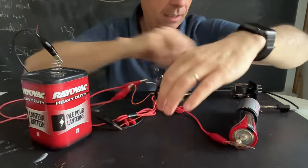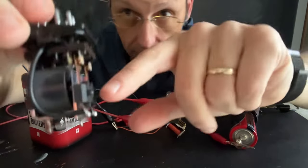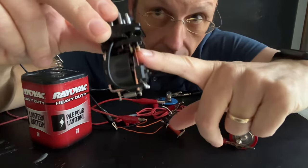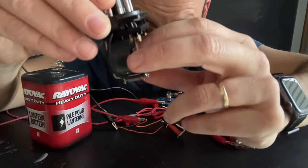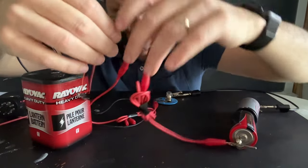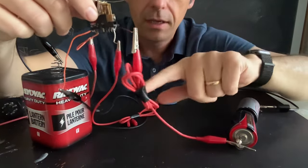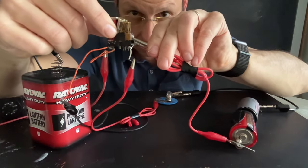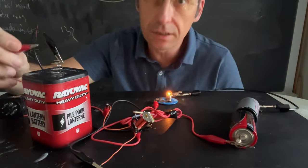So let's try that. Here's my relay, and you can see that in this one maybe — this is a different relay. Right here, can you see that? There are two bars on each side and they're connected. This bar on the bottom gets attracted. This one's on the side and it pulls it towards or away, so it switches contact points. This one's a little different — it's like the picture; it has the bar on the bottom and the contacts up here. Now I have the battery hooked to this side of the switch and the middle. I'm going to switch this over here. You'll notice the light bulb turns on. Now when I turn on the relay, it will disconnect that.